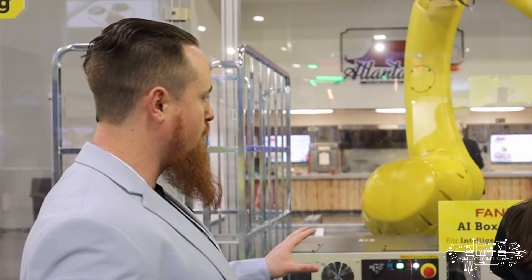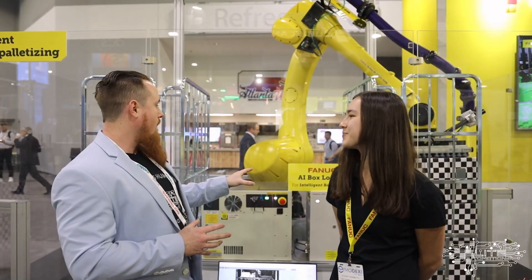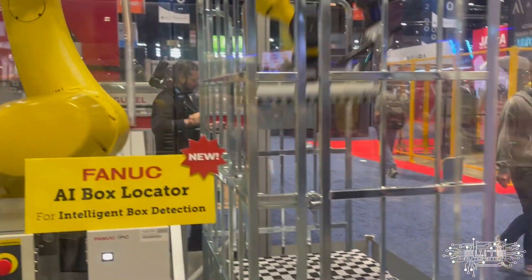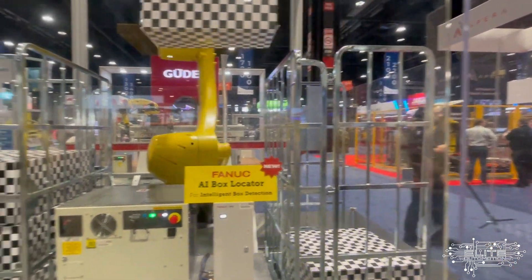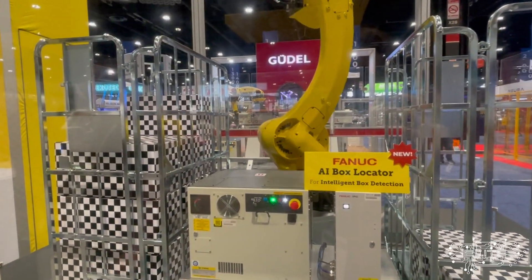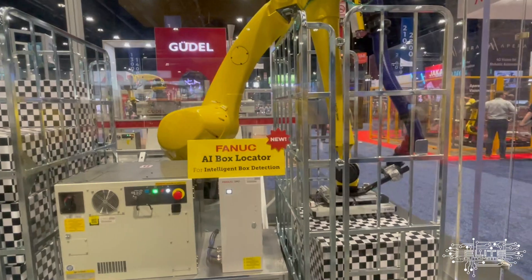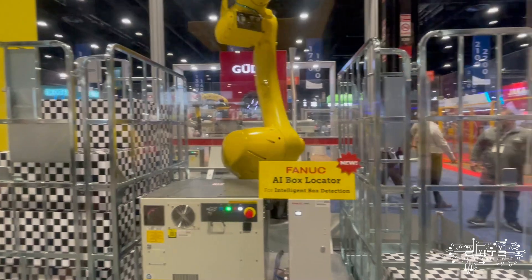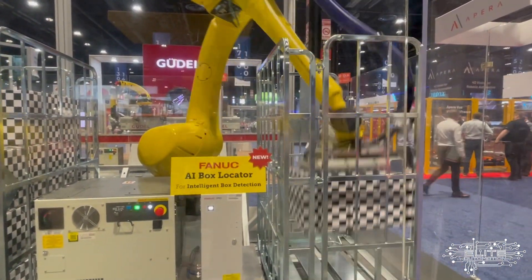Mixed SKUs — if you don't already know what that is — is when you bring in a pallet that has a bunch of different size boxes on it. That's definitely much more challenging than a single size box for palletizing or depalletizing. For the AI box locator, we're using it for depalletizing, whether it be single SKU, rainbow, or mixed depall. And then we're using our pallet tool program on the palletizing side — so we're showcasing really two products here at once.